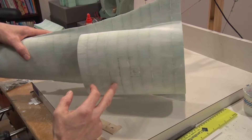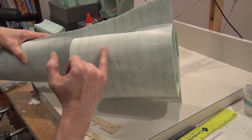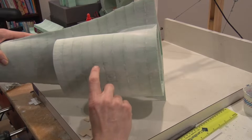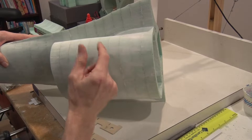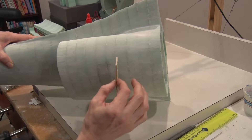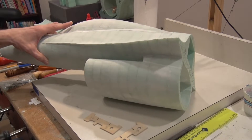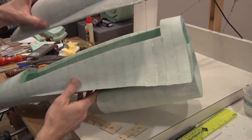The gear door is going to start right here on this bulkhead. After I cut that section off, I'll work with this section. Once I do this cut, I'll cut two lines to open the gear door, and then cut the next line where the second bulkhead will go in — and that's where I'll mount my gear to. You're going to see that take place right now.